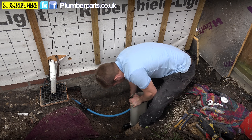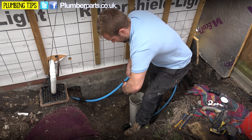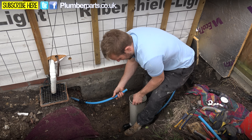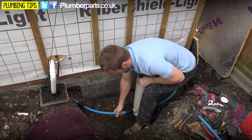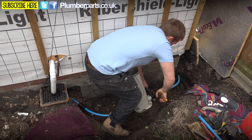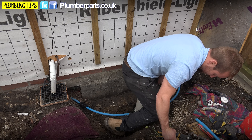It's been cut just about here and as you've seen already, mark that with the thumb — the trusty thumb. Make a quick snip through. Give that a nice feel — just make sure there's no scores on it. That's feeling pretty good. Pop that on in here, lift that lot up, get in there like so. Get that nice little nip. These have got a neoprene insert on them and they can be easy to break, so you want to watch them. You don't want to wring off your neoprene, otherwise you're going to need another Atlas chamber and start all over again.